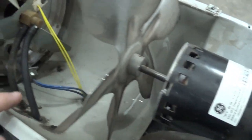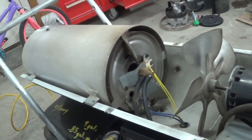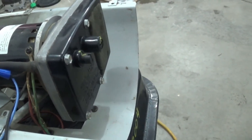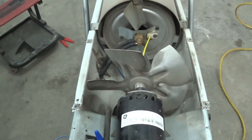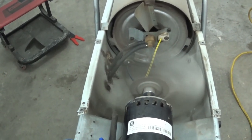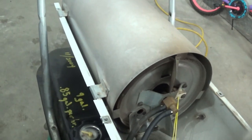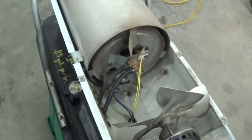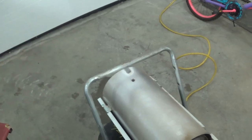You just got to remember to stick this hose back on here. That will blow the fresh air down through here into the injector, which blows through the diesel fuel spraying a nice little mist into the burn chamber. This motor here is labeled with a rotation arrow so we know the fan should spin this way. I think that's installed enough — let's see what it does. It just instantly takes off in the right direction. I'll show you this too while we've got it apart — if you look down inside here, right in there you'll see something glowing bright red. That's your igniter. Now if this thing had diesel in it, it would be spraying it through the nozzle, igniting it.